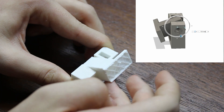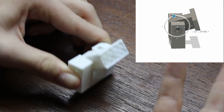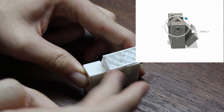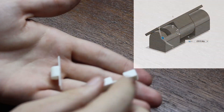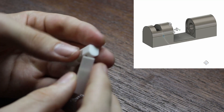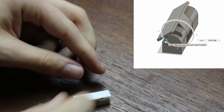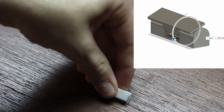Of course it can't hold that much weight and isn't that reliable, but our screen is so small it shouldn't really matter — and if worst comes to worst we can just use two, which is actually what we ended up doing. This prototype is way too big for the laptop, but we can take the concept and shrink it down. And that's exactly what we've done with the final version of the hinge: a similar T-in-U concept, now with rounded edges to make it more streamlined. Slot the two pieces together, put a screw through, and you have a very small hinge that can support quite a bit of weight with good friction.